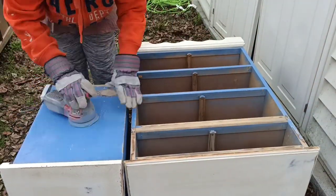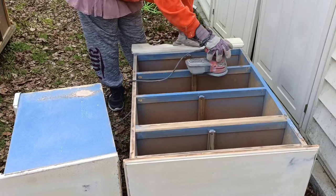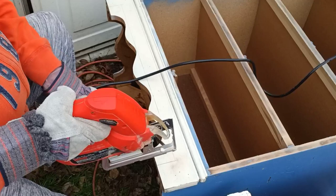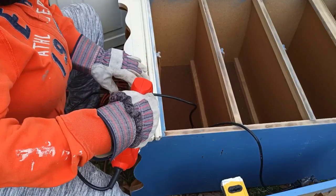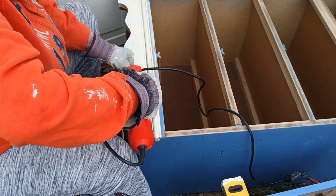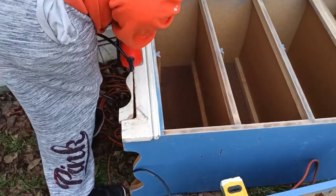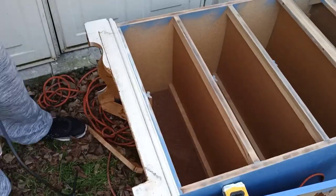There's a lot of glue and residue from where those trim pieces were, so I'm just going to start my sanding process with 220 grit sandpaper, sanding in the areas where the trim was. Then since this is made from particle board I'm going to start sanding down both pieces — I don't think I've ever done two pieces before, so this is going to be quite an adventure. I've mapped out a line across the bottom trim and I'm just going to use the jigsaw to cut this out. I'm getting better with the jigsaw — I was able to do this relatively well so I was really proud of myself. I'm cutting across to get rid of some of those squiggly edges, and I did the same thing on the nightstand.